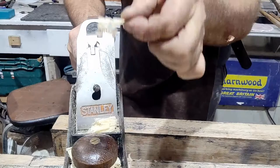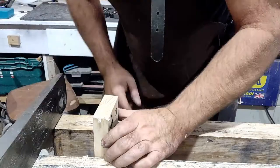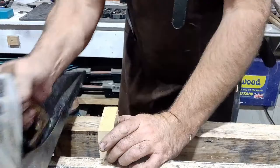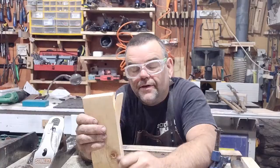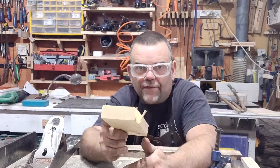We get more aggressive breakout. In this case, the grain is quite straight. But if you're using a piece of wood that's got a knot in it, like so, you're at more risk. You have an angle of direction to your grain and you get a lot of breakout — quite severe in this case. So obviously the choice of timber does matter. It's okay if you're going to be ripping it down to width afterwards. If you're making little boxes or whatever, think ahead — plane that, then rip to width. Don't rip to width, then plane.